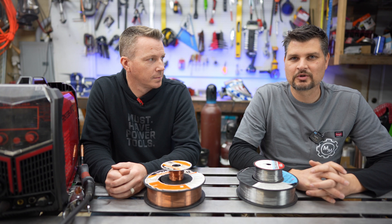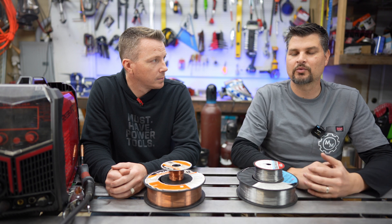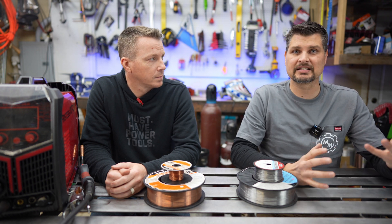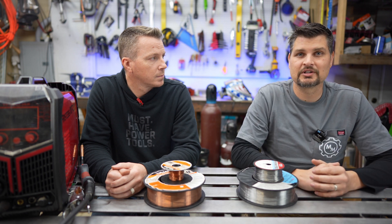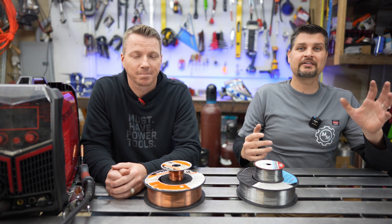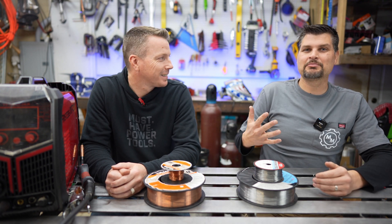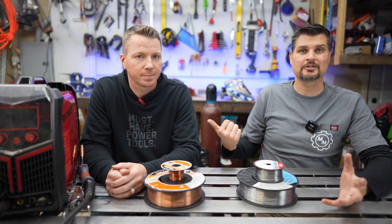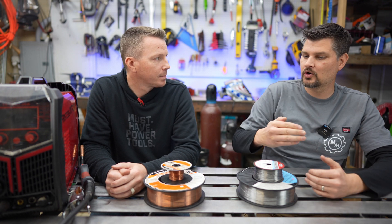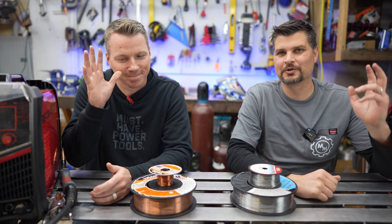The last disadvantage: even though MIG can handle aluminum, it's not great with some other materials — for example, castings. There are thousands of different casting compositions, so in general just stay away from MIG welding any cast parts. And there it is — the five advantages and five disadvantages. Thanks Niels for coming by. If you haven't set up your MIG process yet, that's what he's doing over on his channel right now, so go check it out to see how setting all of this up went for him. Thanks for watching — we'll see you next time.